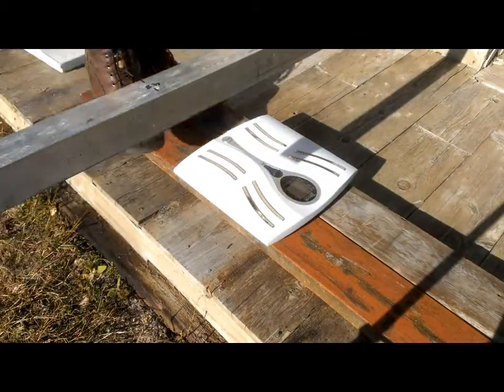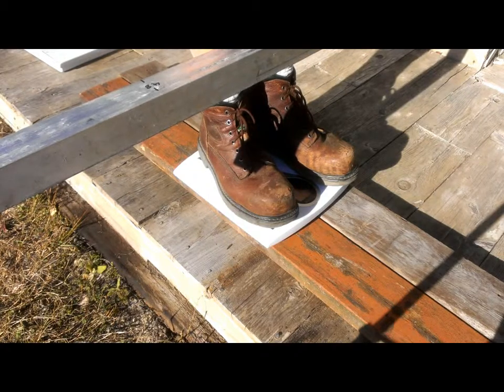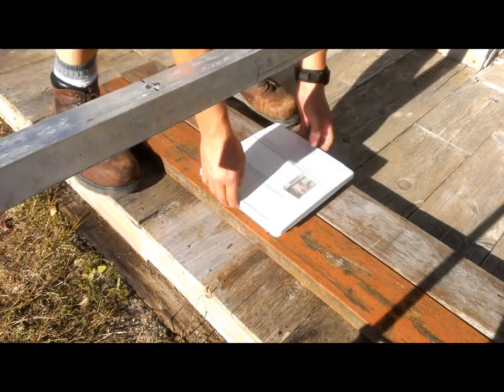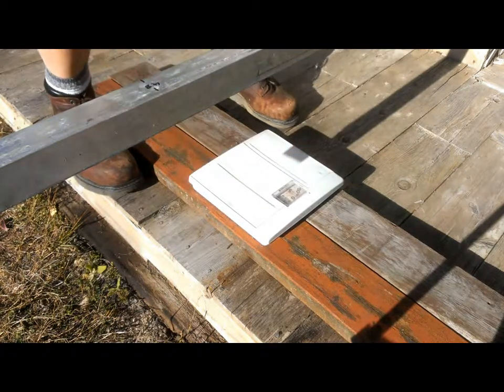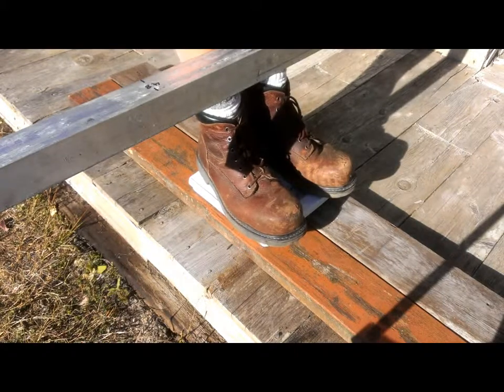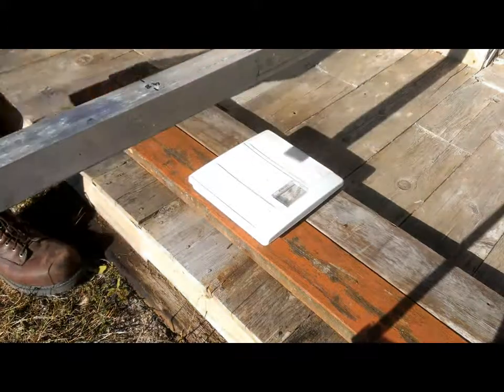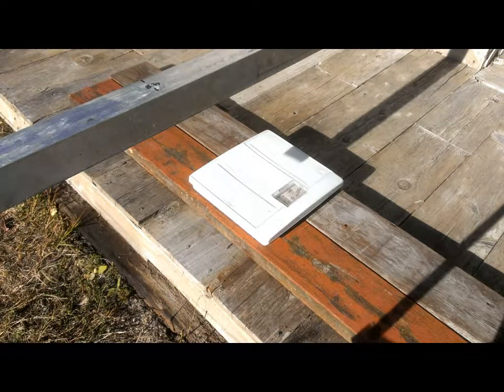Okay, here we are doing our calibration test. You can't see that. I got 223 point, well, actually 224 it settled out at. So that's what it thinks. This scale, line it up on 36 inches, zeroed out. I got about 222, a hair over 222. So again, within a couple pounds is good enough for me. So we're going to build up the weight on top of it to get it squared up. We'll get the hydraulic jack out here and we'll get started.